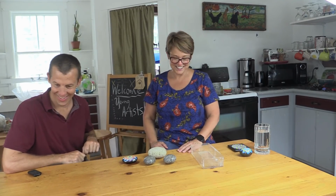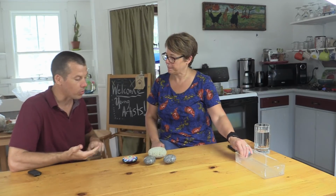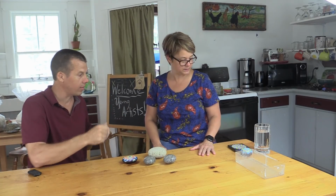That's awesome. So we're going to take one or a couple of your rocks, and you have other shapes as well. We're going to put it in a mold box, spray a little mold release on it, and pour ComposiMold onto it. We'll let that solidify by cooling, and then we'll probably use a ComposiMold plaster. Maybe we'll do one with ComposiMold plaster and also ComposiStone, which is a harder plaster, just to see which one you like better. Then you can paint it and we'll see the final results. So let's get started.